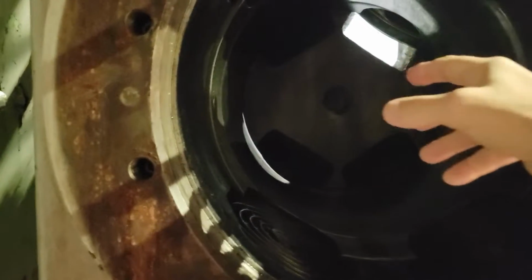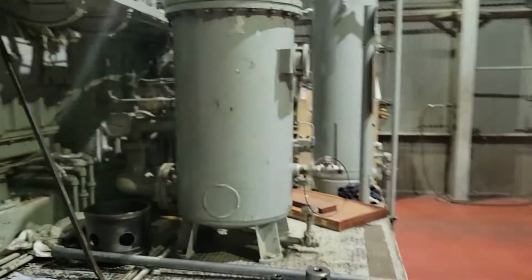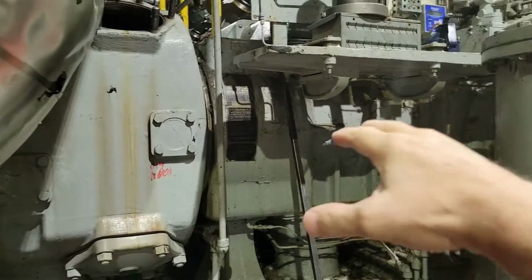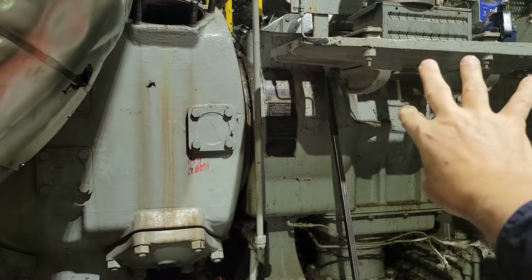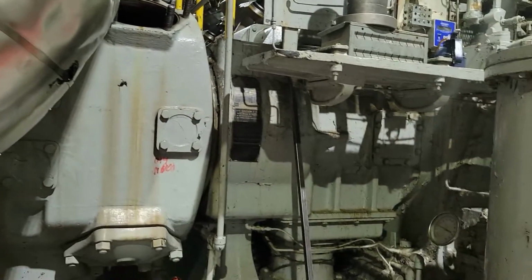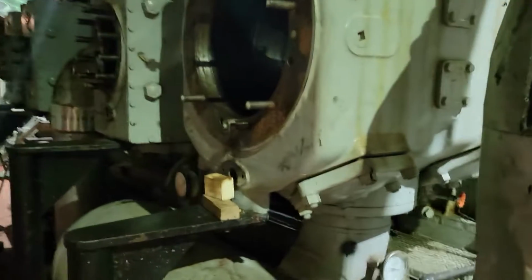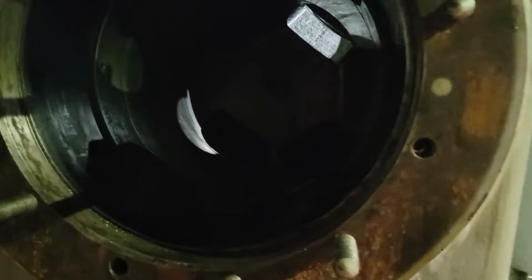it was allowing propane to leak past the pressure packing, and then propane comes into this distance piece here and then leaks out and vents to the atmosphere. You lose propane off the compressor due to that. Right above the pressure packing, in between where the distance piece is, there's a pipe that vents it out to atmosphere.